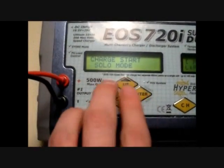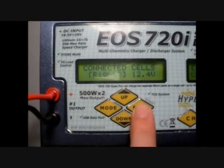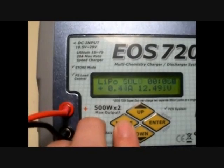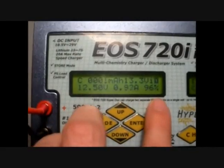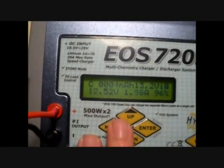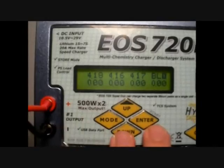Right now I don't have my other battery plugged in so it's not going to notice it. Hold them down and go through the normal check — three cells, is that correct? 12.4 volts, fairly charged. She'll go through the standard paces. On the finish screen you can go back and they actually give you all the information at once: your voltage, how many amps, your TCS cutoff percentage, voltage in at the top, and your current milliamp total put into the pack. The balancer tap lets you see your voltage gap and your cells in series.